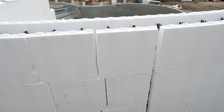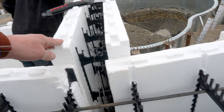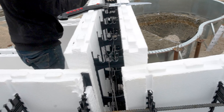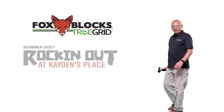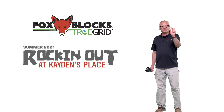Once we've got the curve exactly where we want it, we'll fill it with spray foam and life will be good. On these T-walls we just put a piece of rebar inside some tie wire and did that on every row, and we'll also kick it off. That long sweeping curve with those big gaps — some of them an inch and a quarter wide — we filled them up with spray foam and we were going to strap them.